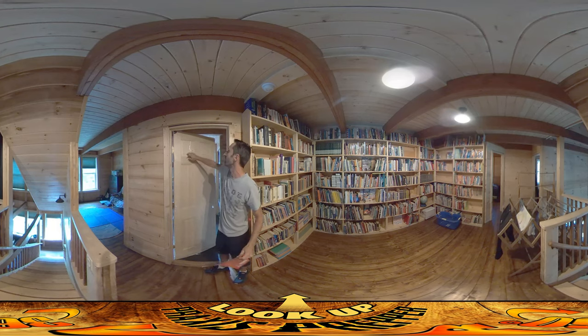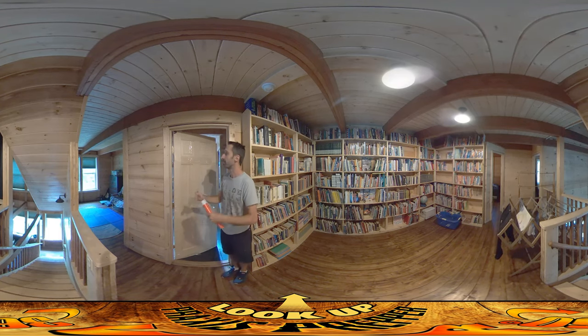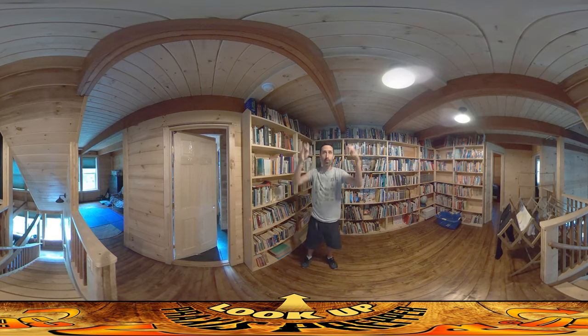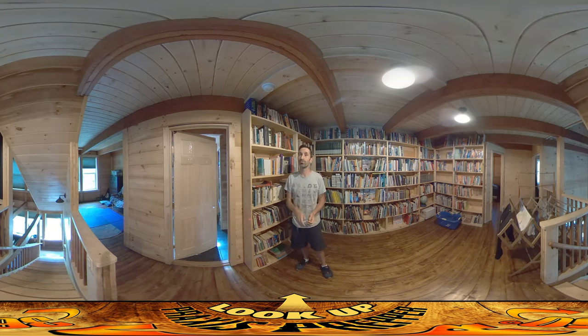She mentioned I should get these things out of here. The reason I haven't unwrapped the doors is I haven't finished them yet — I haven't sealed them. But I don't want to make suntans on my doors, so I'm going to go through the house removing all of these wrappings from all the doors. I remember even earlier in this series I mentioned to people: when boards were sitting in stacks in the sun, if one board slides off the top, it makes a shadow mark — you really see it in hard sun. You can get weird marks on your boards, and the same thing applies to interior doors. So thank you very much to that viewer who does not want to be named — you saved my doors. Otherwise I'd probably be in there with a paintbrush trying to match it later.